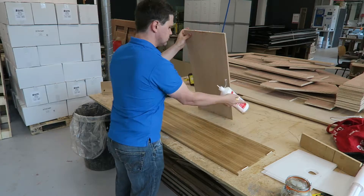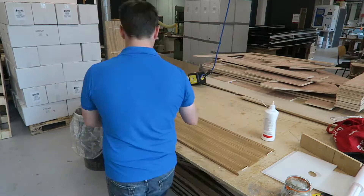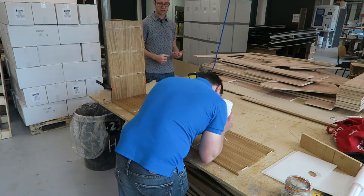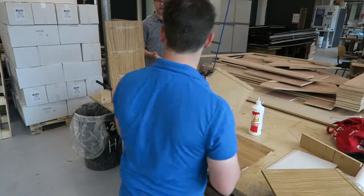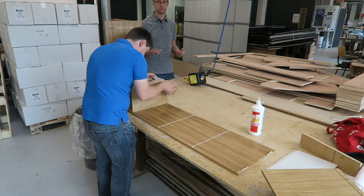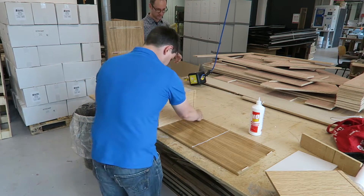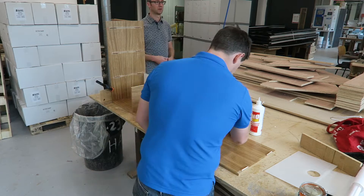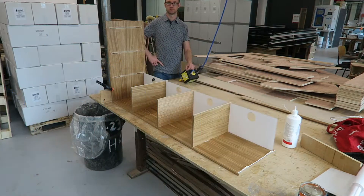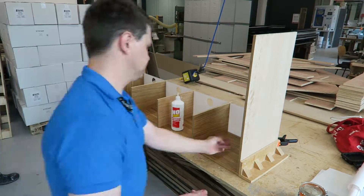What you're going to see is that I'm gluing and biscuiting the joints. It's quite nice that you can see the gap I've left in the finish — on the vertical side you'll see that I've not applied the oil to the areas I intend to glue, so that I can get some decent penetration. The choice to use the back panels for the LEDs is really useful here because it's helping hold the actual frame square while it glues.